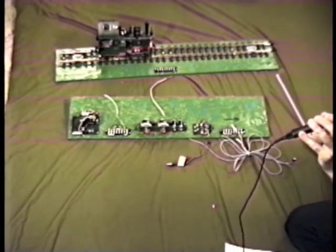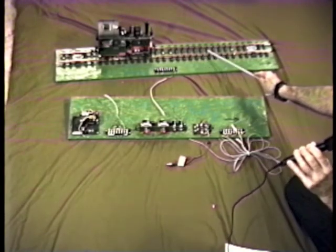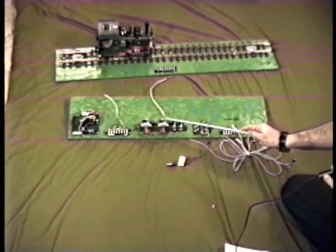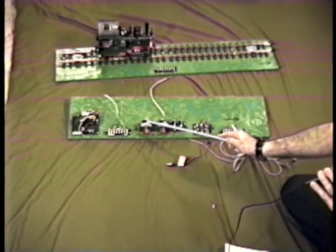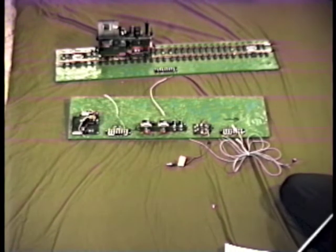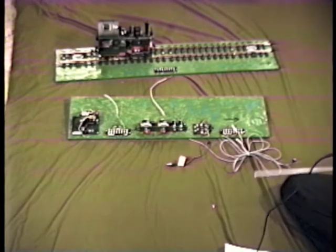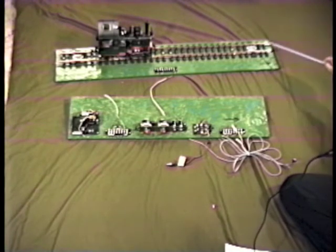This unit uses circuitry very similar to the previous magnetic block. We've got the same on/off section as before, and at the rear we've got the same slow-down section. We've also got the same two double-rheostat type operation, where the rear rheostat adjusts the voltage in the slow-down section and the front rheostat adjusts the voltage in the on/off section. What's different is instead of having track contact T1, which sets the block to red —